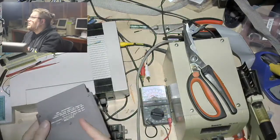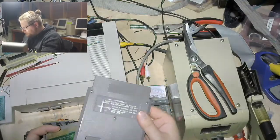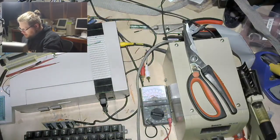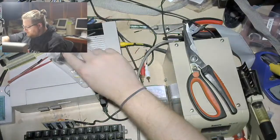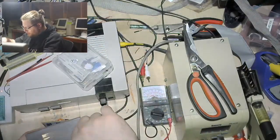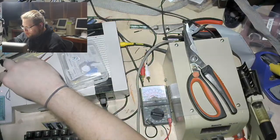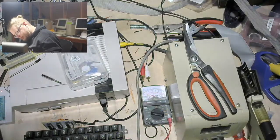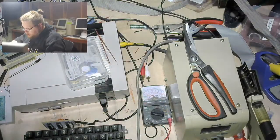And of course, also watch all of the connections get totally effed when I put this back together. All of the wires break. Everything's terrible. Yeah. But at the very least, this should still boot and work as soon as I pull it. No, it should. It totally should. Because we're still using the GAL to handle the mapping, and that won't work for the things that aren't the EEPROM, but the EEPROM is still sitting in exactly the same space that it always was, so we will want to change its mapping a little bit at some point, maybe, so that we have access to more of it, since it now is taking up the entirety of program ROM space, but it should work right now if I just plug this thing together, so.